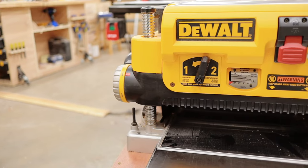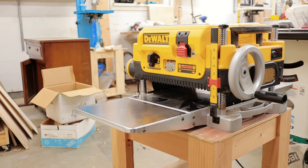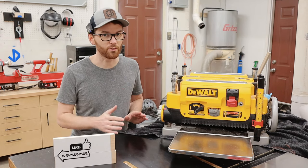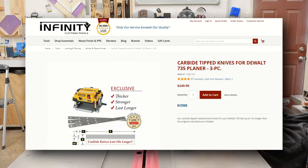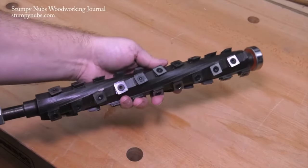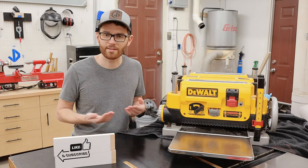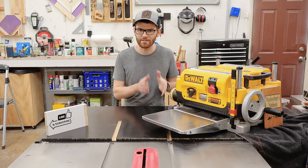Before we get into whether or not I would recommend this DeWalt DW735 or DW735X planer for your shop, it is worth mentioning that the planer is in a class of its own. It fits in this weird category of prosumer grade equipment that is not meant to be portable, but doesn't quite hit the beefiness level of a commercial grade planer. However, this is a pretty popular planer sitting in this exact category all by itself. There are a few really interesting aftermarket upgrades you can make: the first are carbide planer knives, which are supposed to last a lot longer. And of course the holy grail — the carbide tooth helical cutter head. Most commercial grade woodworking equipment uses helical cutter heads with small carbide inserts, which leaves a smoother finish and cuts a lot more efficiently. When the carbide inserts get dull or chipped, all you have to do is rotate or replace single inserts, which is way cheaper than replacing a set of $55 proprietary planer knives. I just wanted to mention these upgrades because I think they're worth considering if you have the budget for them.